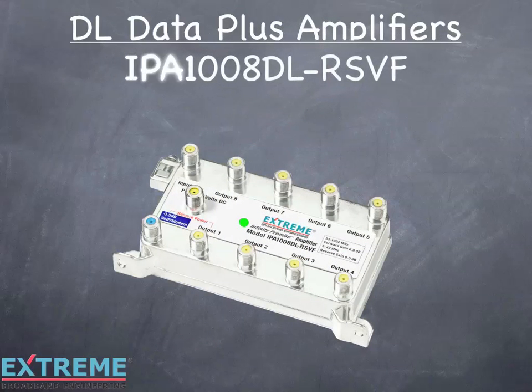Let's take a look at the port layout for the IPA1008DL-RSVF Data Plus amplifier. The D stands for data port and the L for local powering. We call these amplifiers our DL series. As with all of our Data Plus splitters and amplifiers, the input port is located on the top left and the passive VoIP modem port is located on the lower left. The passive port is identified with a blue port color and blue label, making installation easy and standardized. EMTAs and modems would be connected to this port. Since it is a passive port, it would not lose service if there was a power interruption to the amplifier.